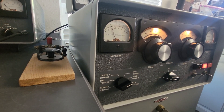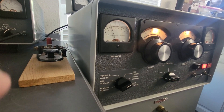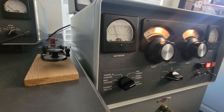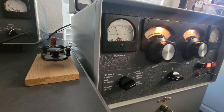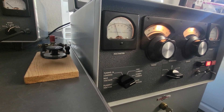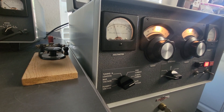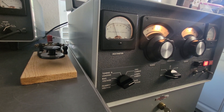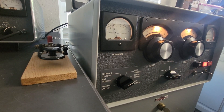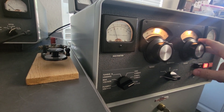These things get pretty touchy on 20 meters and the higher bands. If you had the key down at 600 watts and you grabbed that tune control and went out of resonance — just turned it a little bit too much — it's going to slam that screen current negative or positive depending on which way you turned it, and it can happen right away. What I recommend is keying it momentarily and working fairly quickly to get the output power peaked and get the amp in resonance. You'll see that screen current will peak whether it's low, high, or zero, and you just use the loading control to get it back to zero.